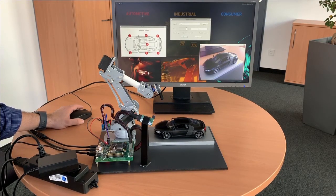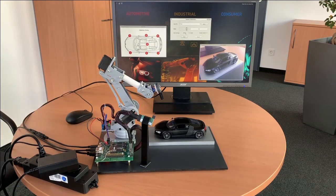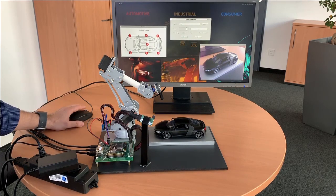Basically all the information from the failure was lost. Now if I change this to FRAM — it's very simple. One of the features of FRAM is that it's fully memory-mapped, which means you can easily change the storage location, and now everything is going to be run and stored on the FRAM.